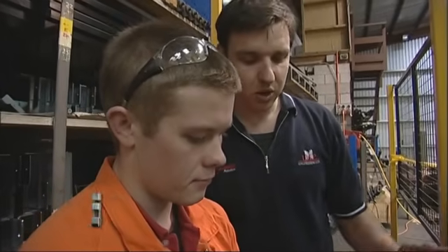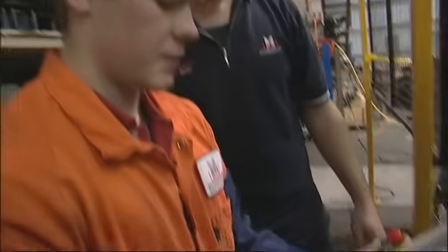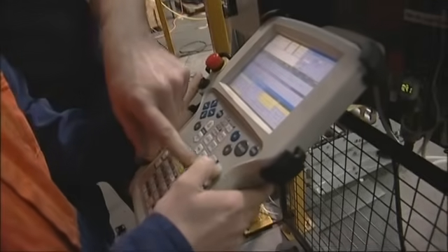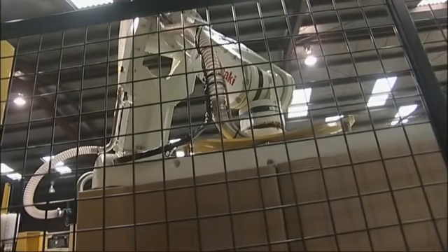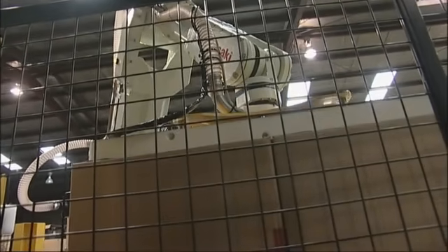Robot's now live. Your first motion you want to do is straight up out of the accumulator. So hold the Z-plus down. Hold the Z-plus, hold that down. Keep bringing it up, keep bringing it up. Rise all the way up until it's clear.